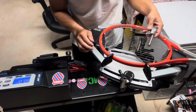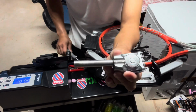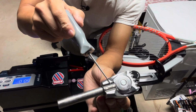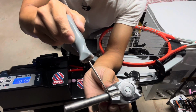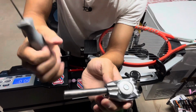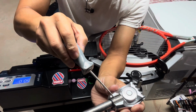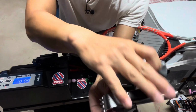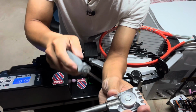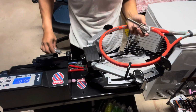Okay, and the other maintenance item to check would be, see this clamp over here? There are actually 2 screws that came through from the other side. These are just the threads that are flush against this post. Once in a while, they loosen up, and then this whole rock could have movement. So I've had to tighten down both of these screws from the other side after removing this top piece to get to the screws on the bottom. So it's something to check every so often to prevent clamp slippage or movement.